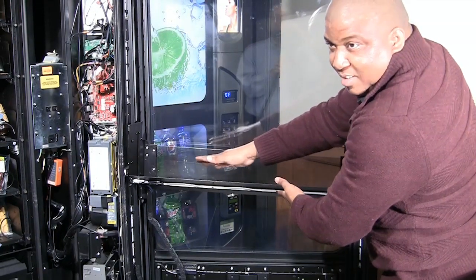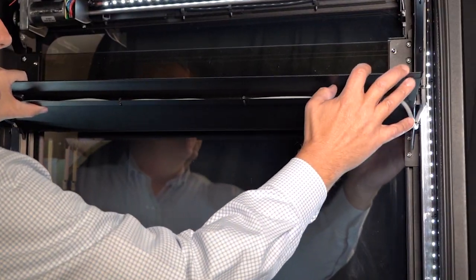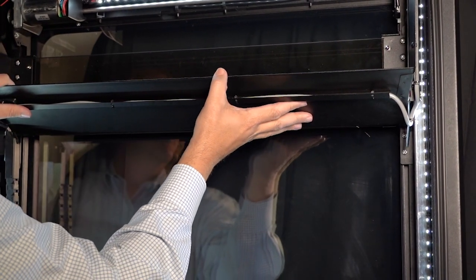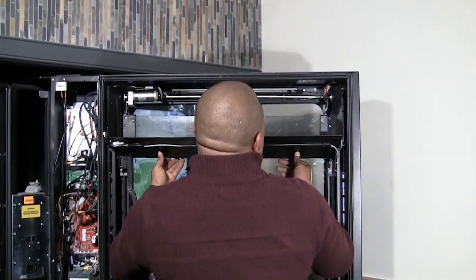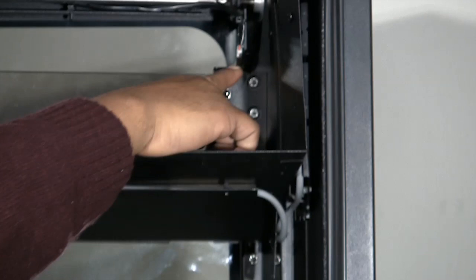The next clip shows a bin misaligned and how to adjust it. Hold the left side while applying vertical pressure on the right side — you will hear a click or two. Realign the bin so the right side is one tooth higher than the left. Raise the bin to the top of the door to check for left spacing from bin to frame of around an eighth inch, and ensure the top limit switch is contacted. Adjust the alignment of the bin further if needed.